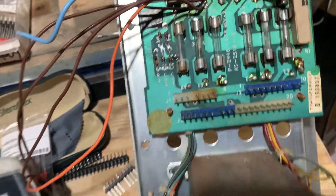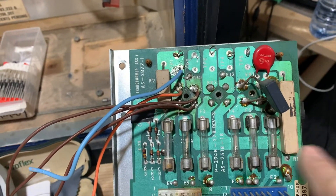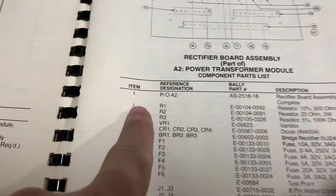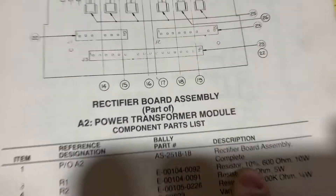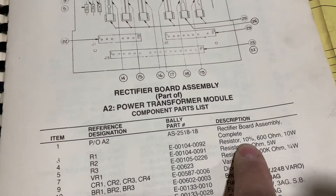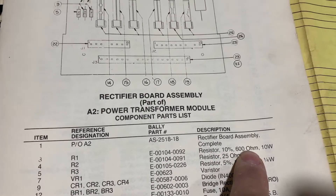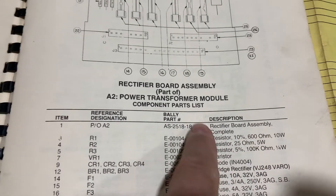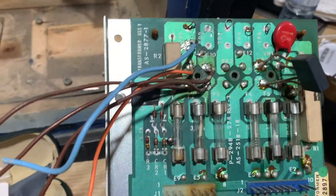You can check the big resistor here as well — you just look at the manual and find the corresponding entry. R1, for example, is a 600 ohm 10-watt resistor. The 10% tolerance gives you some variance, so if it measures at 570 ohms it's still good because you're within 10% plus or minus of the 600 ohm value. Then you just shoot down the list for everything you need to check as far as all the measurements.